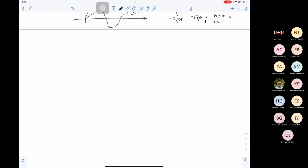To give you an idea, let's say we have a robot arm, and this robot arm is tracking a point. The first type means that this point is stationary in space. So I'm telling my robot, follow this point. And this point is, if this is 0, at -5 and +3. So we will tell our robot, follow -5, 3. Okay, this is our X value, this is our Y value. So your robot can move until it goes to -5 and 3. It can go in the space, then stop here. It can do some overshooting. It can go past the point and then go back, or it can go very slowly to the point,